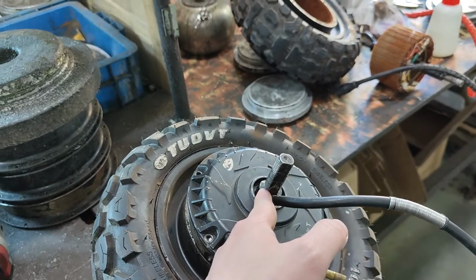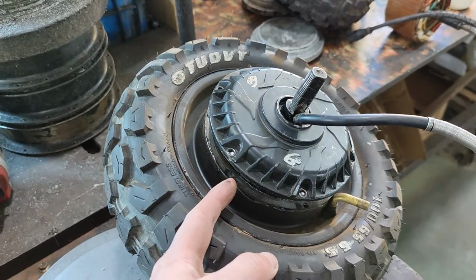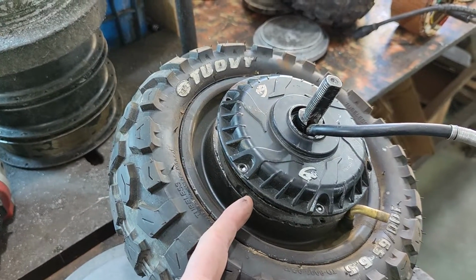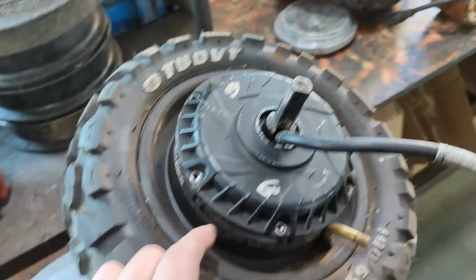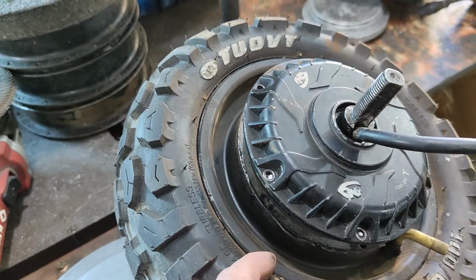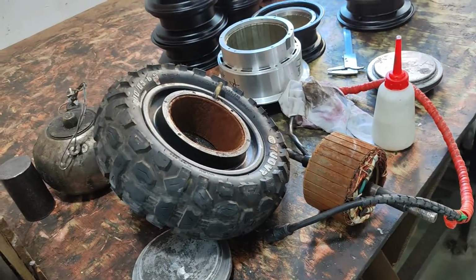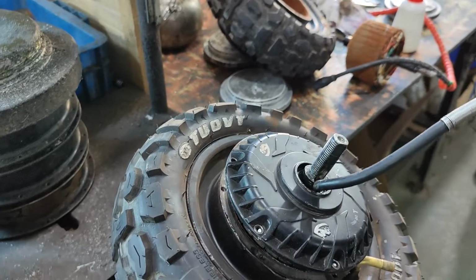The oil seal has a service time. The silicone here needs to be applied once the cover is open. And these two parts will protect the motor from the water, but they cannot protect the motor from moisture. So the service, like here, needs to be done in 2 or 3 years, even if no water has ever entered the motors.